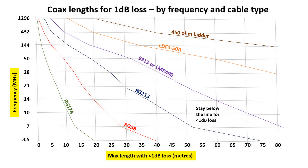If you were to use that same 5 metres of RG174 on 432MHz, you would be losing most of your power. So I wouldn't recommend RG174 at all for the higher VHF frequencies. But 28MHz and below for about 5 metres is okay. If you're only concerned about lower HF bands like 7MHz, then even a 10 or 12 metre length would be fine.